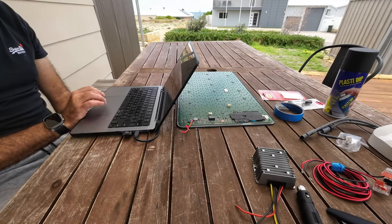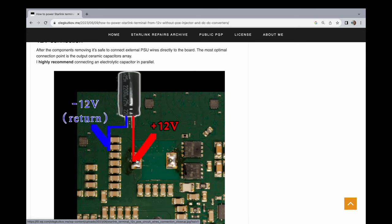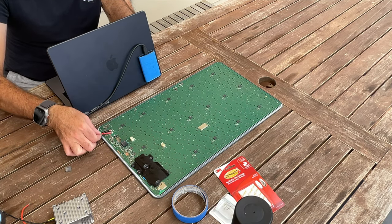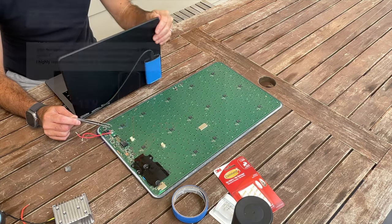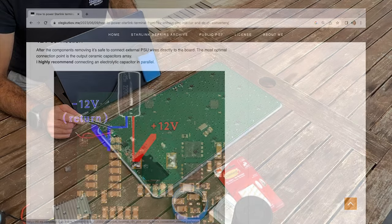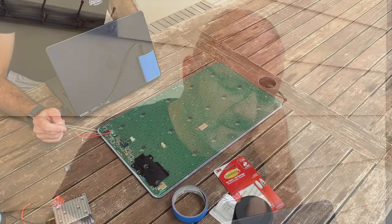The only other bit he shows in the article is how you can connect up the 12-volt supply directly. One point is the pad where we removed the big inductor, and as you can see I've already done that piece of soldering. So that's going to be the positive coming in there. And then the negative goes across these ceramic capacitors — all of this side of them is negative. So it doesn't matter if you have a butchered soldering job like I have — you can just connect up a few of them. Solder on these two points for your 12 volts.